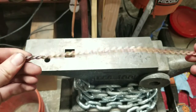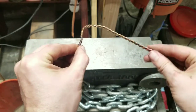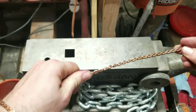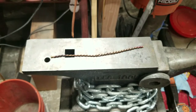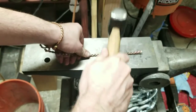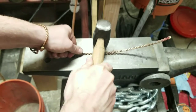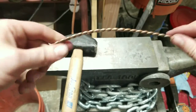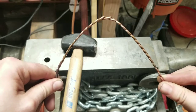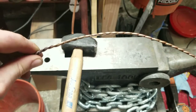Here we have a piece of twisted but softened-again copper — softened through the heating process. I'm going to grab both sides and bend it to show you how easily it wants to bend back and forth all day long. I'm not putting almost any pressure at all. Now watch — let's work harden this. You can see right there how instead of flexing very easily, you get that really tight bend; it's even pulling apart. Before it was nice and flexible, but now the twist is actually coming apart because it's too stiff. If I were to keep bending it, I'd actually break this wire in half.